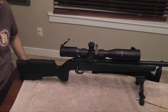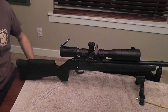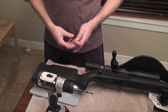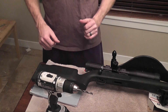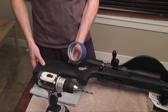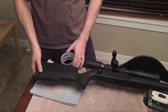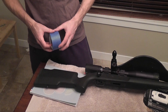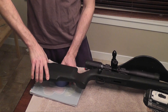So then what I'm going to do is use the cordless drill — if you've got a drill press, that'd be a great thing to use, but I don't. The drill bit I'm using is a quarter inch, and I'm pretty sure that's what these bolts are as well. I've just kind of propped this up — I don't have a fancy vise or anything. So I've put a notebook underneath so this doesn't turn into a fail video and I drill a hole through my wife's nice table. I actually should have taped this because a lot of times the finish will chip when you drill it.